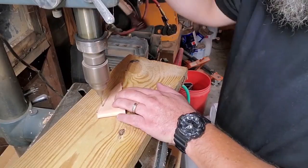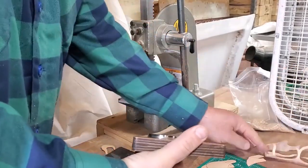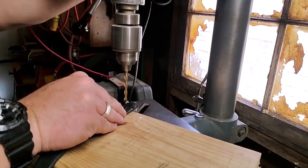So to summarize: drill presses with a drum sander for edge sanding, drill presses for drilling out hardware, drill presses for stitching holes — but drill presses are NOT for setting rivets. Please don't even try to set snaps or rivets with a drill press. You're going to ruin your drill press, you won't be happy, and your bit's going to wobble all around. Drill presses are for drilling, maybe some light edge sanding without hard pushing, but I wouldn't go further than that.